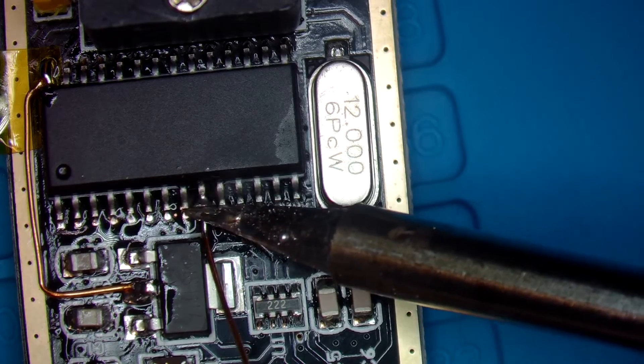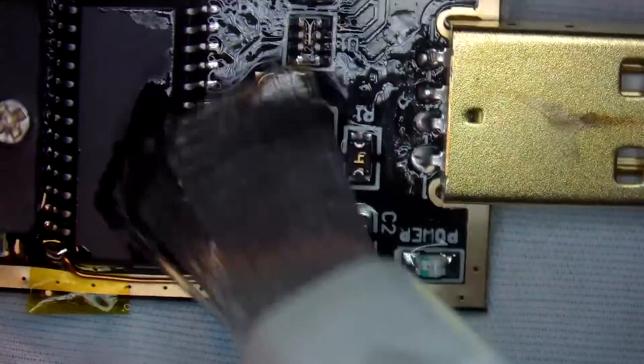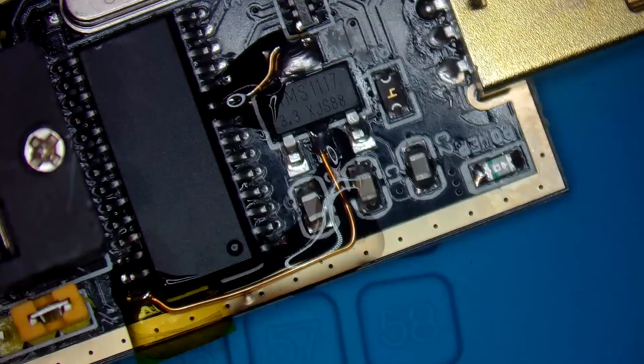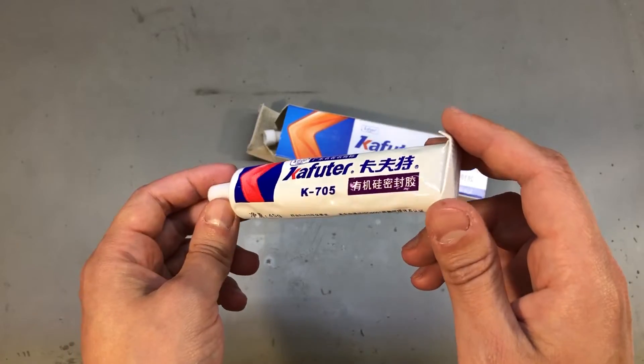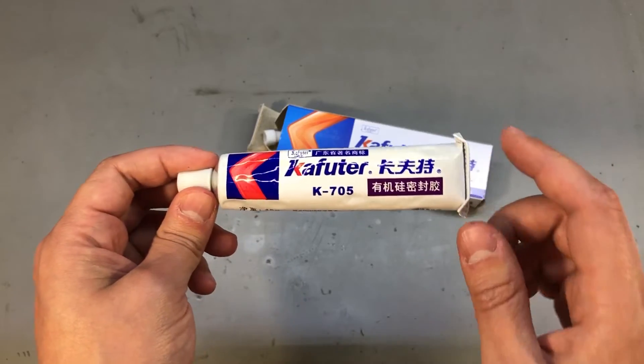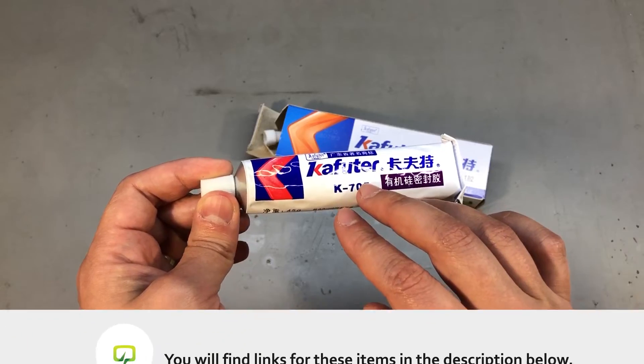Next I did the same connection for pin 9, but this time there is no need to lift the pin from the PCB because it's just connected to a bypass cap. To finish this off I recommend adding some kind of glue to the wires to prevent them from breaking off. I used some transparent silicone adhesive — apart from the fact that it cures pretty slow, this is awesome stuff.